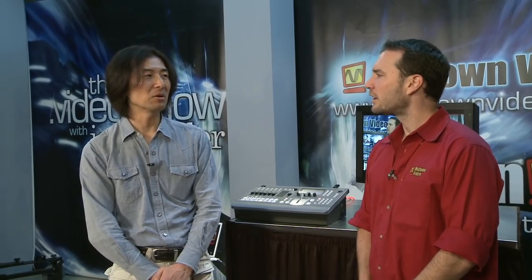What about outputs? How many outputs do we have on the switcher? Actually, we have four SDI outputs, everything labeled as a program output, auxiliary output, and also a multi-viewing output — which we have on the screen behind us. You can assign another signal onto the interface. Even for the program output, you can assign a preview, multi-viewing, auxiliary preview, or program output. So four HD-SDI outputs, two DVI outputs, and they're all independently assignable. Anything could be a single camera, a program, a preview, or an aux.